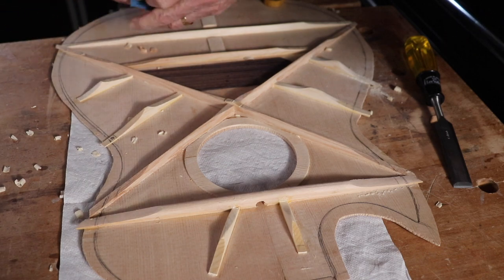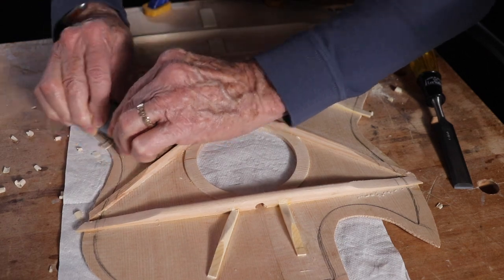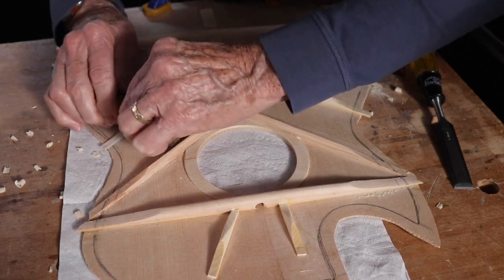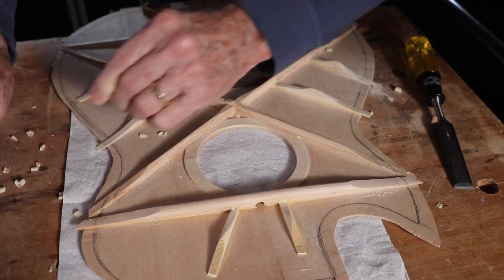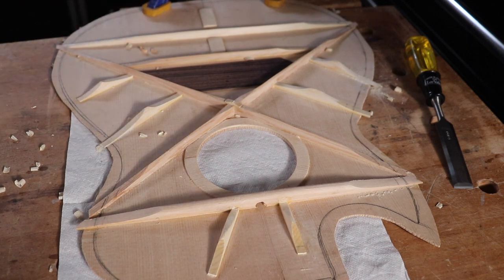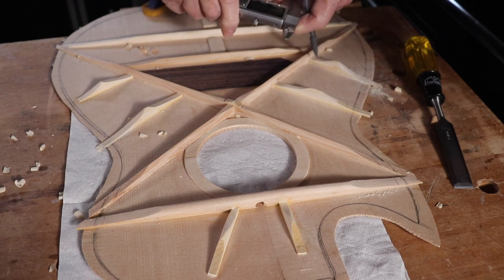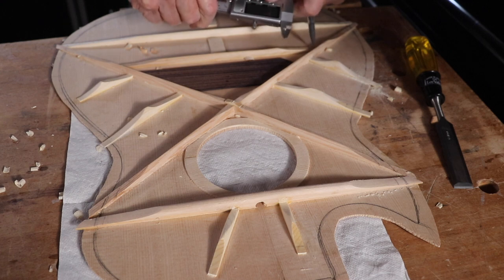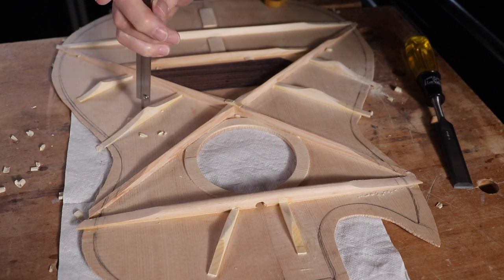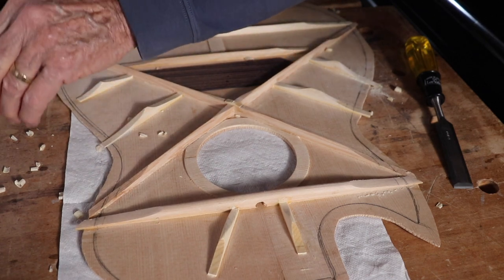In order to make sure I've got it nice and smooth, I just take a piece of dowel, wrap some sandpaper, and I just sand it. These nodes run here at about a half an inch in height, and that's all you want — it could be slightly less. We'll just check this because we can. I'll put it on the inches. So that is exactly a half an inch. Exactly. I'm happy with that.